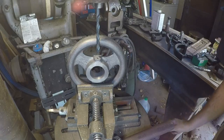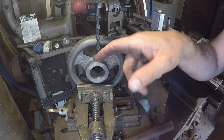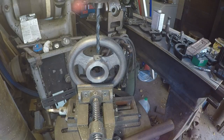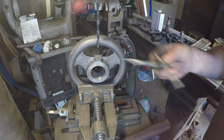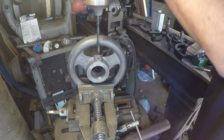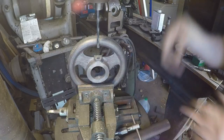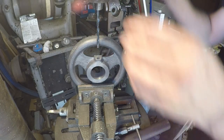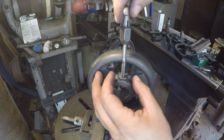Got to be more careful doing this stuff. Nobody's perfect, but learn from my mistakes so you won't have to learn from your own. We're probably going to have to go down in bolt size — it's too far down the hill. I think a number seven is the tap drill size for a quarter-20, so we'll probably have to end up going with a quarter-20 instead of five-sixteenths. I think we still got enough meat to make that happen, but it's a little on the small side with kind of thin material here. Let's get our tap set up.